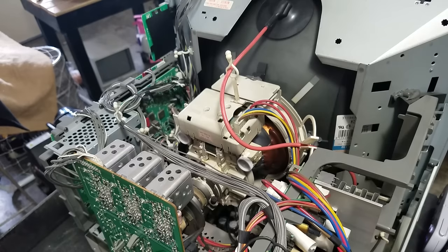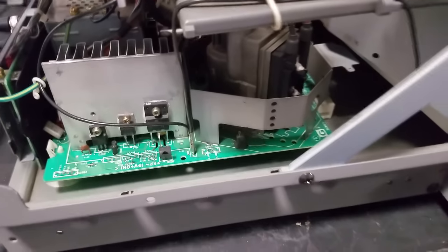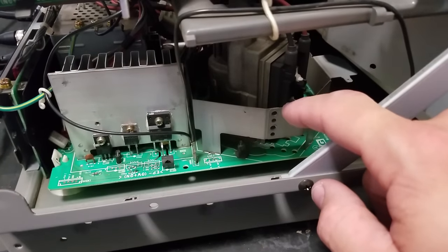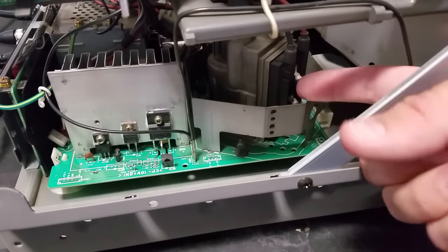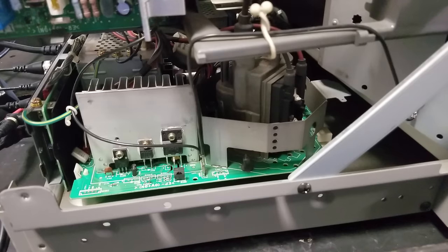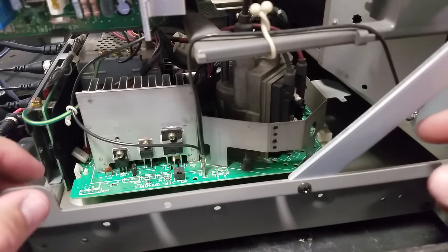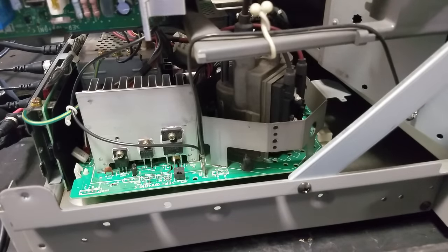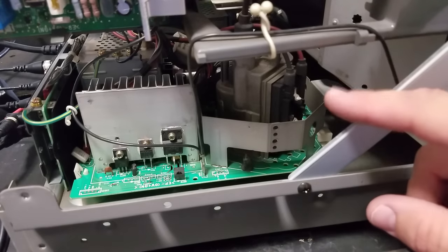Some other things similar to other monitors: if you follow the high voltage line, let's look from the side at the flyback — it's not as easy to get to as on the 20L2, but it is side-service, so you can get a smaller screwdriver in there. Note that a lot of times when you open these monitors, you'll see silicone was originally applied to some of the adjustable potentiometers. The service tech would set the potentiometer and then silicone it in place, hoping it wouldn't go out of adjustment. Occasionally you'll need to tighten up your focus — usually the top potentiometer — if you notice the image is blurry. This monitor does have a focus setting in the sub menu.